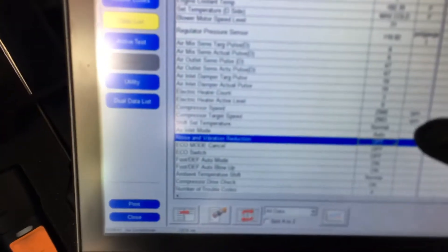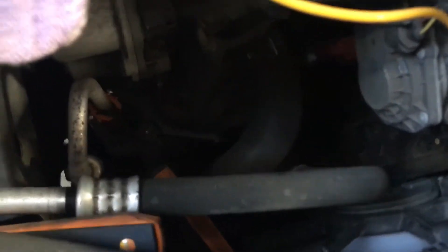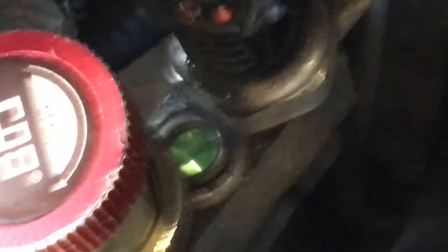So this is the difference. You can see our RPMs have fallen down to 2,900 RPMs on the compressor — you can barely hear it. I hear the fan motors more than the compressor. And for the guys who like sight glasses: here's a clear sight glass — that keeps those bubble boys happy.